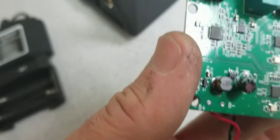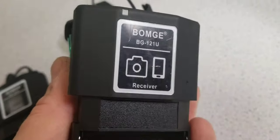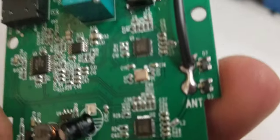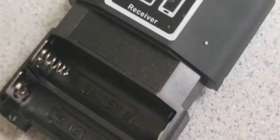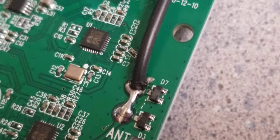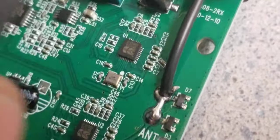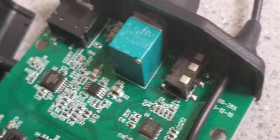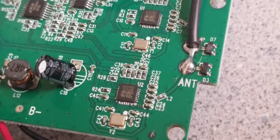Back to the receiver — this is actually a sticker; there's nothing behind it, no LEDs, just a sticker to distinguish the receiver from the transmitter. Look at the PCB — this is cheap stuff. If you look at the antenna solder joint, let me zoom in — they did not do a good job reflowing here, so I'll have to reflow that. Like I said, there are two receivers built in: U2 and U1.